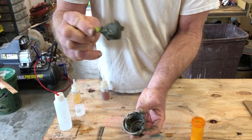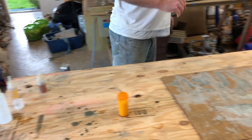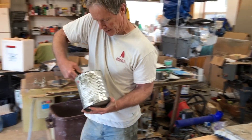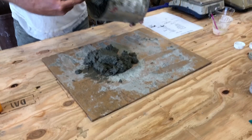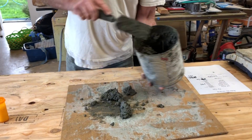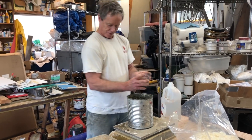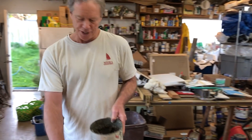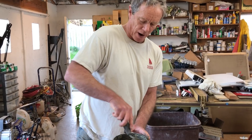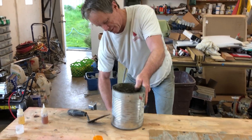So while these guys are setting for a while — this is really like a false set — I'm gonna do a similar experiment with some actual concrete. This is a batch I just mixed up. That's kind of stiff; that's probably about a three inch slump in a big pile. Let me make this a little slumpier so the effects of our admix will be more apparent. I'm gonna add a little more water — let's go about another five grams. This is a yard of concrete scaled down where pounds are turned into grams, so this is effectively about 4,000 grams worth of concrete.